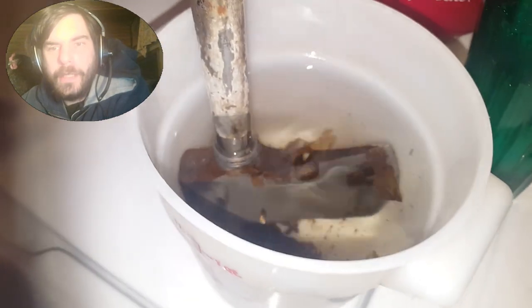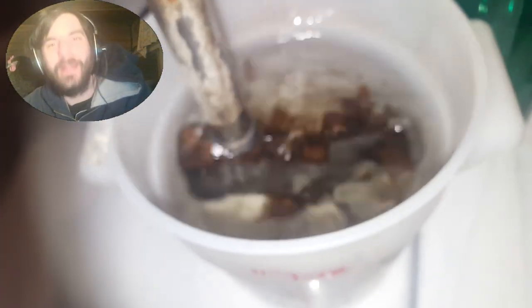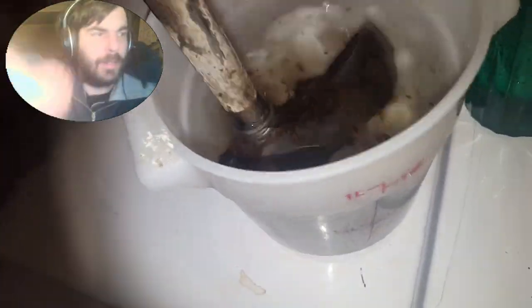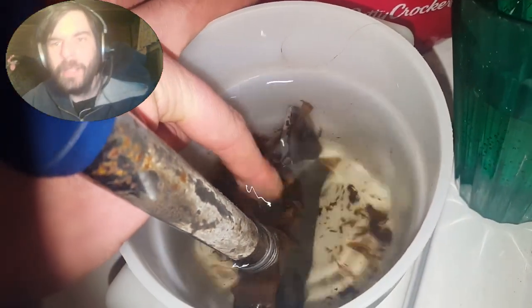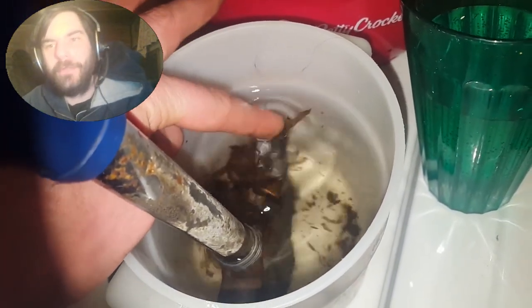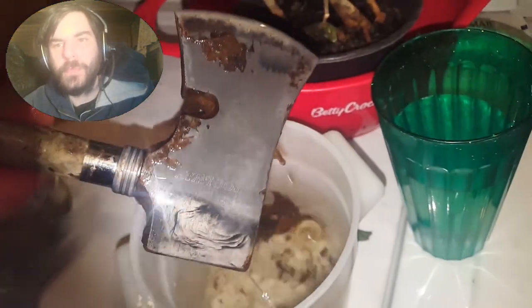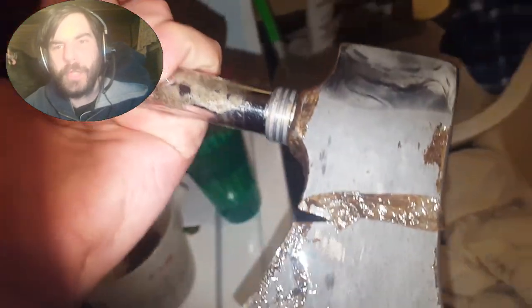Like my Pulaski there — I found that in the barn. If you've seen some of my videos, you've seen the barn, and it's not a good barn. It's like a hundred-year-old barn that's collapsed, and I found it just rooting around in there one day. It was buried, so I kept it. I restored it with vinegar — not like this; I didn't have enough to submerge it, so I wiped it and rubbed it, just got it to turn into black phosphate best as I could and rubbed it off. But this hatchet wasn't buried in the ground for 20 years — it was just left outside and been snowed and rained on, so it had more of a surface rust. After you convert it to the black phosphate, it just peels and pulls right off.